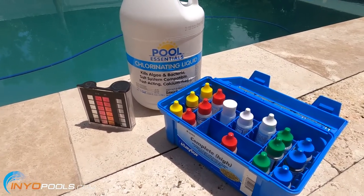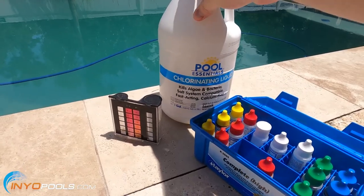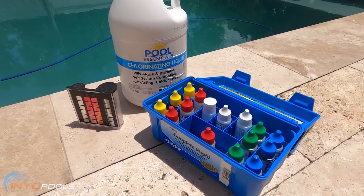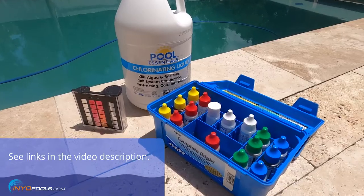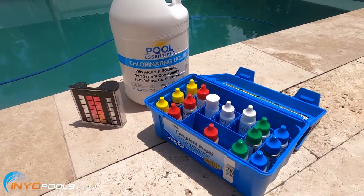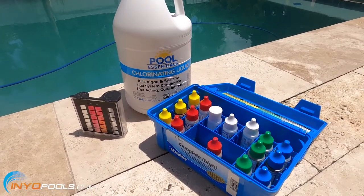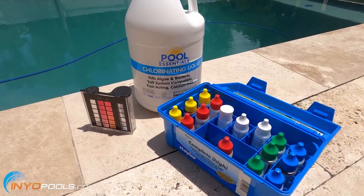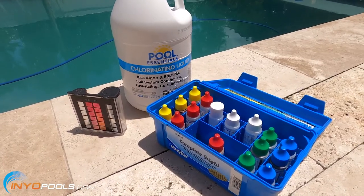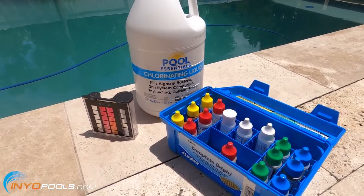For this example, my pool is 10,000 gallons and the chlorine level is currently zero. I've got liquid chlorine at 10% sodium hypochlorite. Using our calculator on the website, it tells me I need basically half a gallon to get it up to 4 parts per million, but since I want to double that I'm going to add a full gallon to shock the pool. There are other variables that go into that, like cyanuric acid level — mine is currently 30 and my normal target is around 4 ppm. Check out the sources we link below to figure out how much you need to add to get your chlorine level up.